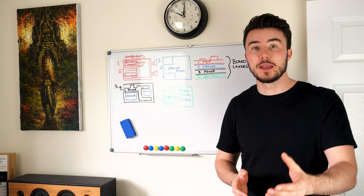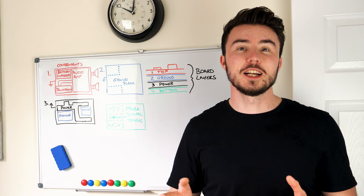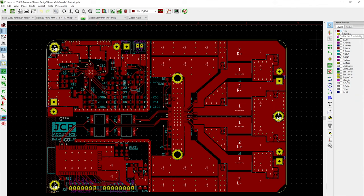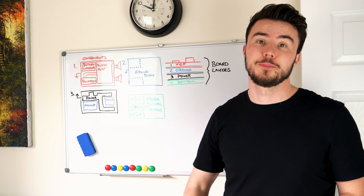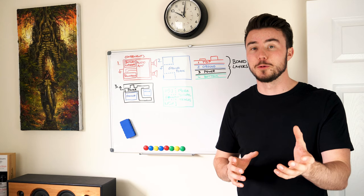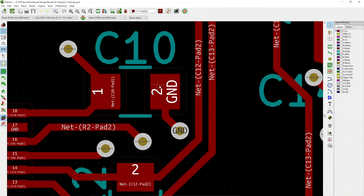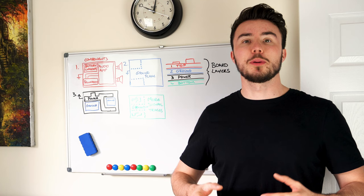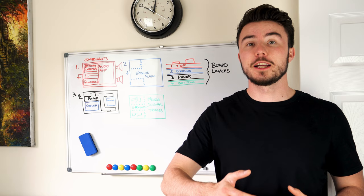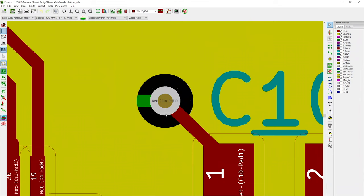The potential drop and impedance across the traces was too high to give accurate readings, so the charger couldn't detect the battery and it didn't function. As a general rule with a four-layer board: the top and bottom layers are reserved for signal traces, the second layer for a solid ground plane, and the third layer for thick power planes and traces. Areas on layers which aren't the ground plane should be filled in with more ground plane. The exception is that in areas highly populated with components, it's best to run a trace directly to a via next to their ground pad so each has its own direct route to the ground layer. Planes of the same net — ground planes, power planes etc. — should be stitched together with vias, which create a contact all the way through the layers connecting them together.